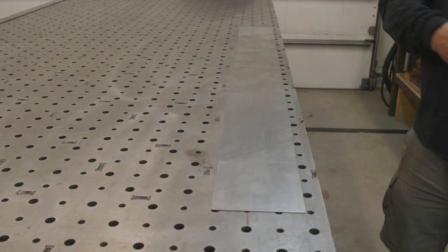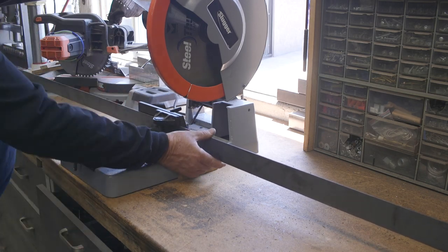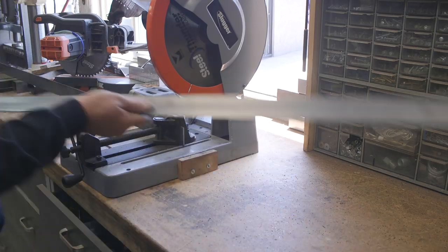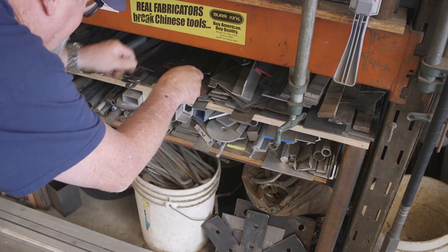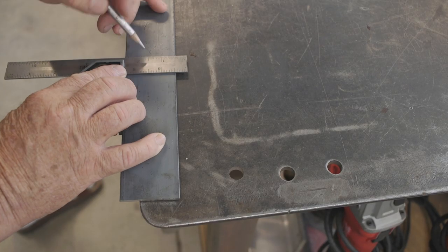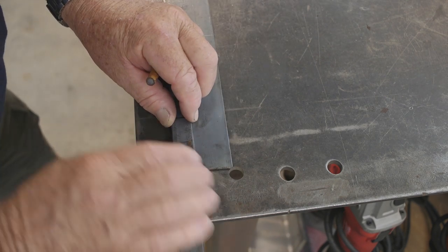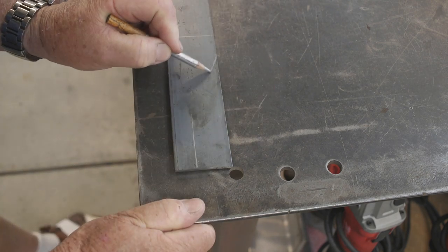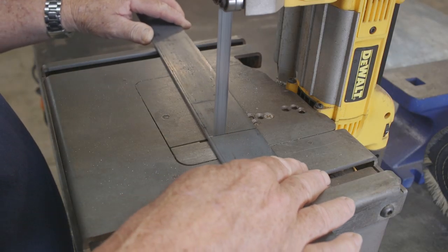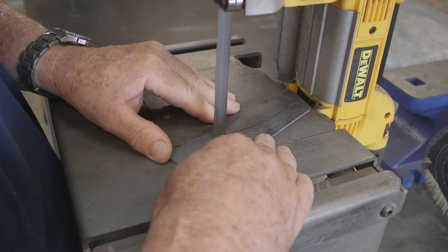There's the first piece. The idea is to get all the pieces I need to put this thing together, and there's really not that much. This piece of two inch by eighth inch flat bar stock is what I'm going to use for the very back. I also found another piece of two inch by eighth inch for the shorter side pieces. I'm going to put a little design on the sides — a little curly-q, a little radius in there — just something a little different rather than keeping it nice and square. Let's take it over to the DeWalt portaband and cut it off.